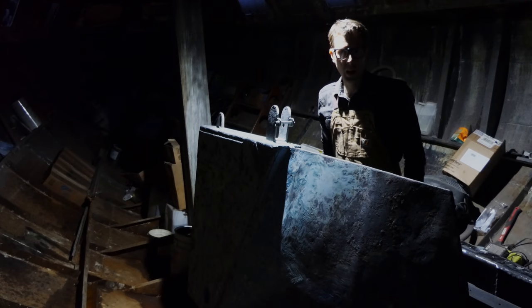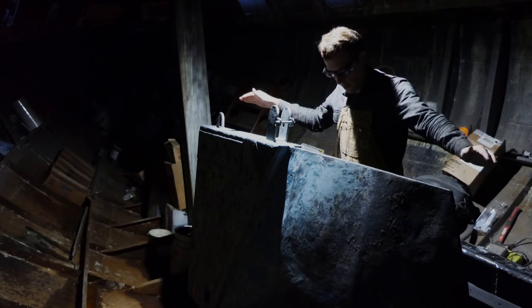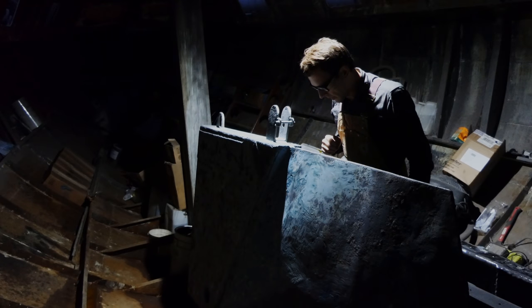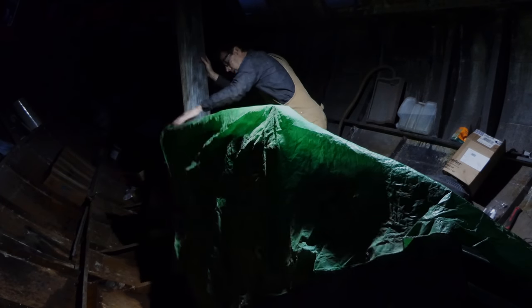It's 9:30 p.m. and we have some unscheduled rain going on. And here where I have my work area is actually a hole through the deck, so I need to get a tarp over top of this so no water gets onto my uncured epoxy. I need to get five coats done, so we almost got there. It's time for the tarp before any water gets on. Okay, that should keep it for the night. I'll show you the results tomorrow.